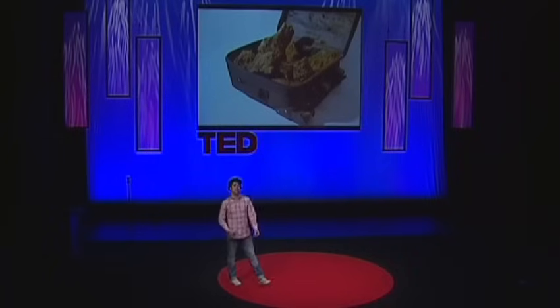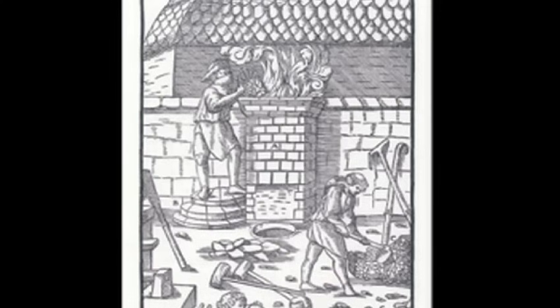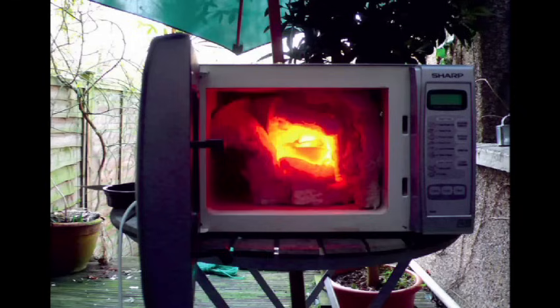So I went back to Professor Silias and he said: go to the library. So I did, and was looking through the undergraduate textbooks on metallurgy — completely useless for what I was trying to do, because they don't actually tell you how to do it if you don't have a smelting plant. So I ended up going to the History of Science Library and looking at the first textbook on metallurgy written in the West. That woodcut is basically what I ended up doing, but instead of a bellows, I had a leaf blower. The smaller the scale you want to work on, the further back in time you have to go. After a day and about half a night smelting this iron, I dragged out this stuff — and it wasn't iron. But luckily, I found a patent online for industrial furnaces that use microwaves, and 30 minutes at full power and I was able to finish off the process.